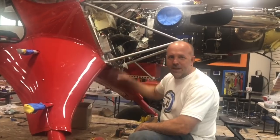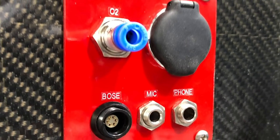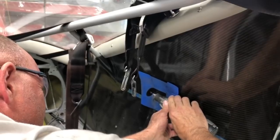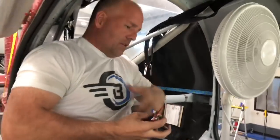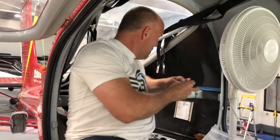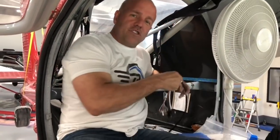We're still wiring the airplane. Here's a cover plate — I've got to put two of them in the back of the plane for the rear two seats. We've got oxygen, a power port for your phone, and all the different jacks. I'm going to cut the wire harness and stick it right here so someone in that seat can reach back and plug in their phone. The headset jack cords will all be behind you and come up in the middle.